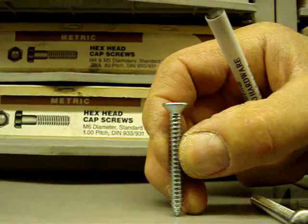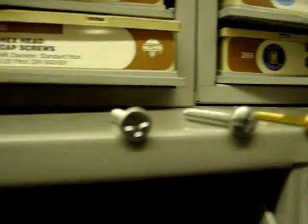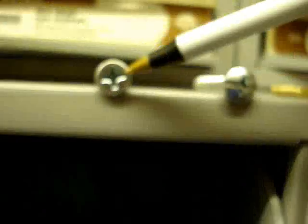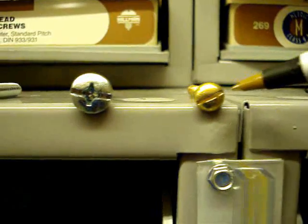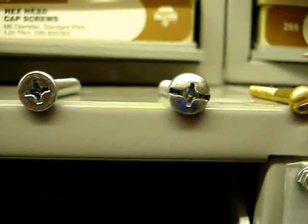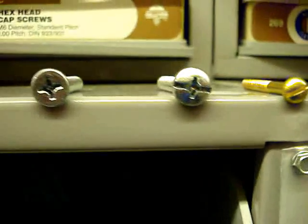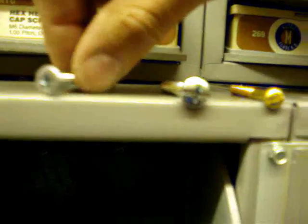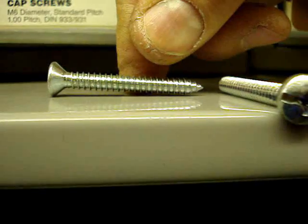And here, of course, is the flathead screw — when it's installed, it will be flat. So while we're looking at these screws, we can notice the different kinds of screwdrivers they take. This screw is a Phillips. This screw is a flathead or slotted screw. This screw is a combo-headed screw — it's got a slot and it will take a Phillips, so it is a combo. These screws, when fully threaded, are good for going into sheet metal and wood. The threads are deep, there are a lot of threads, and they're very strong.